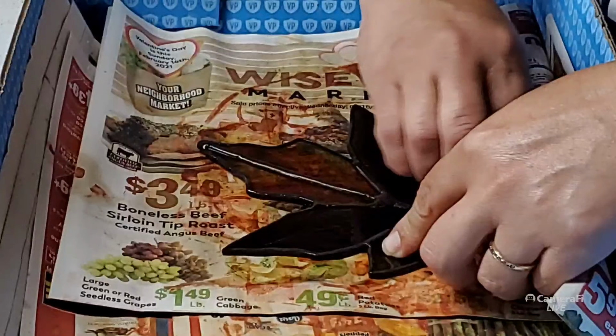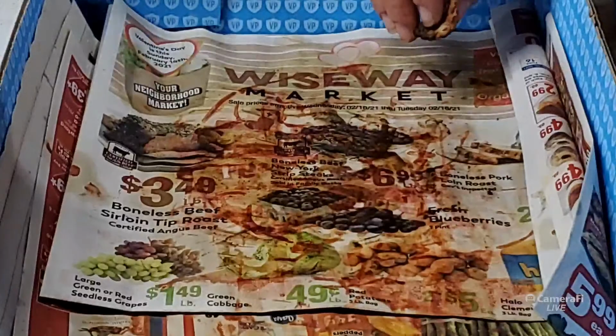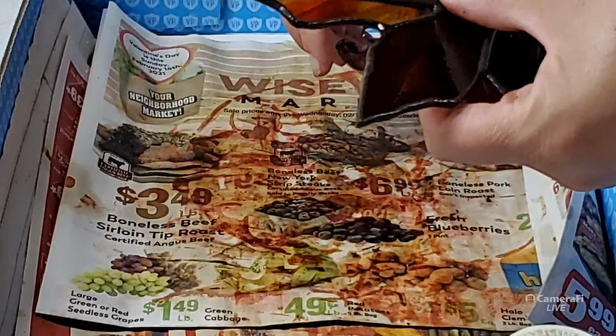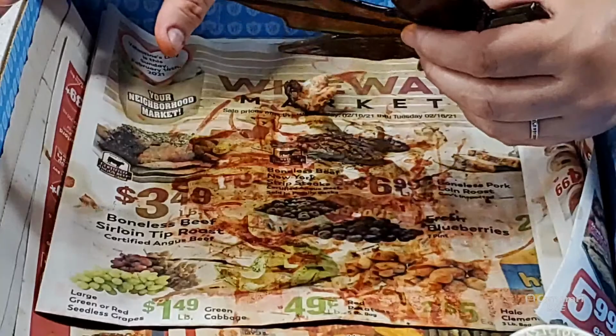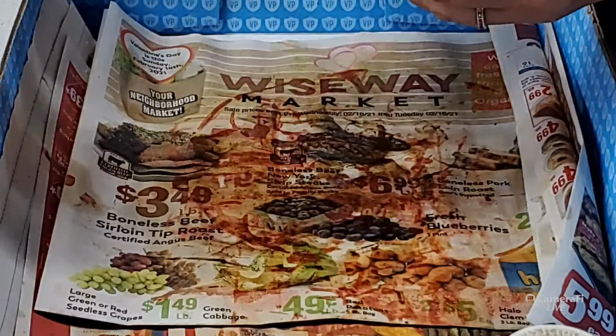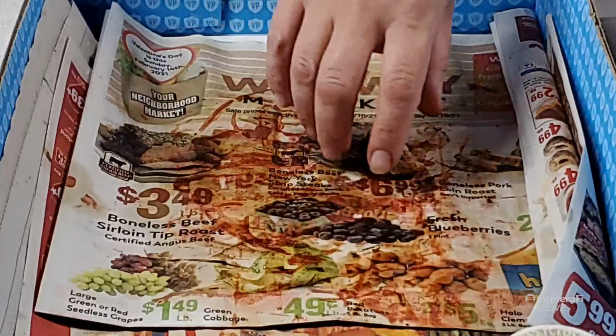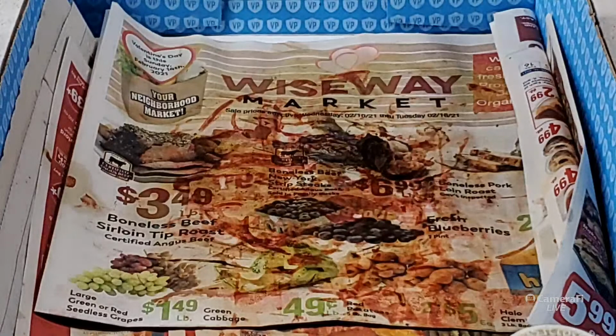Okay. All right, now that it's all patinaed, I'm going to go wash it in the sink over here. I have patina cleaner, and I use water as cold as you can get it, cold water to rinse off the patina. It seems like using the warm water, we have softened water, it kind of wants to leave a residue, and sometimes the solder turns white. Some people say you didn't get all the flux off, but I scrub, and it still turned white. So in my experience, the best thing to do is run it under cold water. I'm going to run over here to the sink, wash it off. Take your time, don't scrub it.